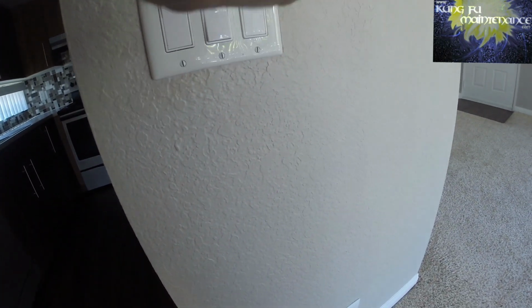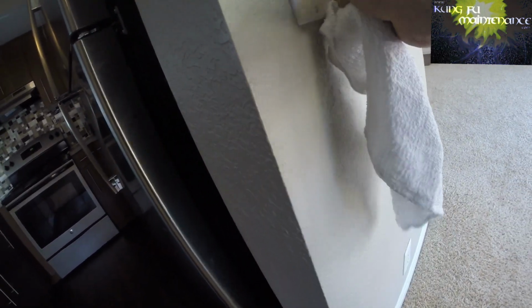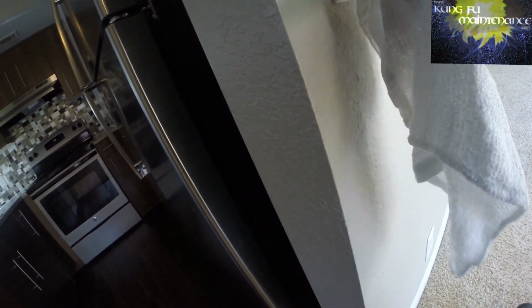One good idea when working with electricity is always to turn off the breaker, but pretend that it's always live so that you understand how the power is flowing and protect yourself by using insulated tools. It's just good practice to pretend that it's always live, even when you turn off the power. It'll help you develop good habits, and in some situations, it could spare your life or spare you harm.